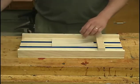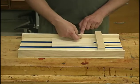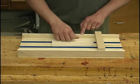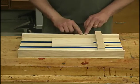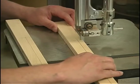So what we need to do, in the area where we'll be routing, we need to drop this fence area down so that it only stands proud of our base by about 3/16 inch, maybe even as much as 1/4 inch. And we'll do that operation over at the bandsaw. Now I'll start out by making my stop cuts.